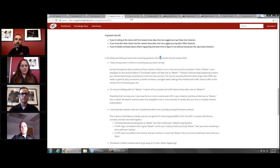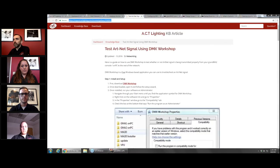People asked about testing these protocols. We have an article on testing ArtNet. People call us, asking, I don't think your console is sending ArtNet. I'm like, yeah, it is. All your settings are right. No, it's not. Say, why don't you test it? Well, once you test it, you discover that the MA is actually transmitting ArtNet, and it's your receiving device settings that are wrong.